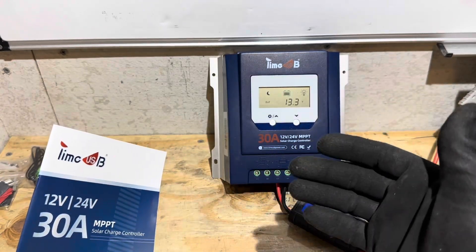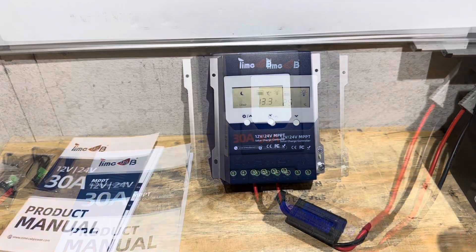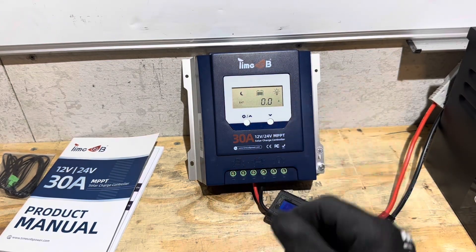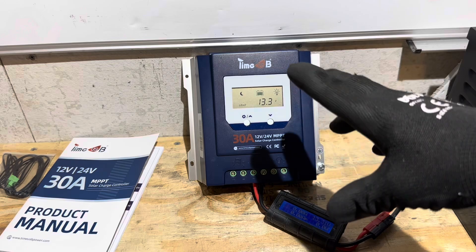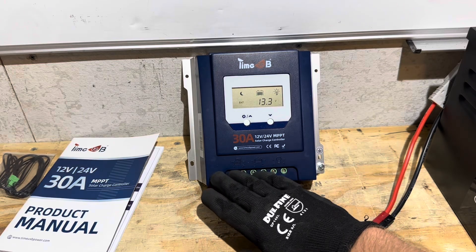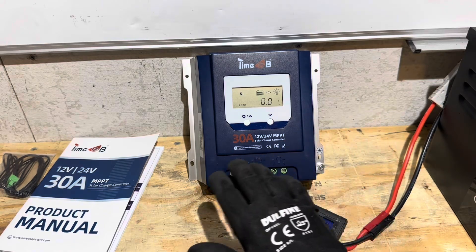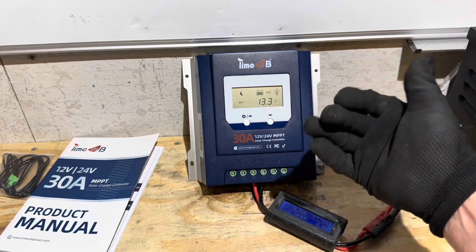I don't know if it's going to stop at 14.2, 14.4, or 14.6 volts — is it going to hold a float at 13.8, 13.6, or 13.4? Is it going to do a rebulk at 13.2? No idea — they should include that in the manual. The over-paneling was no problem; it current-limited at 30 amps, so the hardware is probably decent. It's just the operator interface that's poorly executed. At $79 — ranging from $70 to $89 — with no Bluetooth, no protective wire covers, for a few more dollars you can get a 40 amp controller with Bluetooth and protective covers. This controller either needs to be a lot cheaper or needs to be revamped.